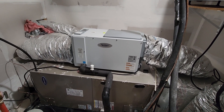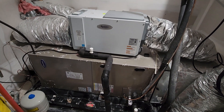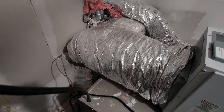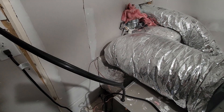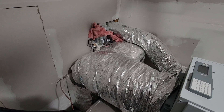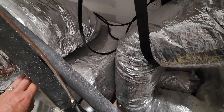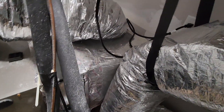This is the setup for an Aprilaire E100 sitting on top of a three-ton Carrier AC air handler. The intake for the Aprilaire is here — it's coming from the supply, which is the cold air returning back into the house. That goes down to about 2,000 square feet on the first floor, going through the unit, and then back into the return.